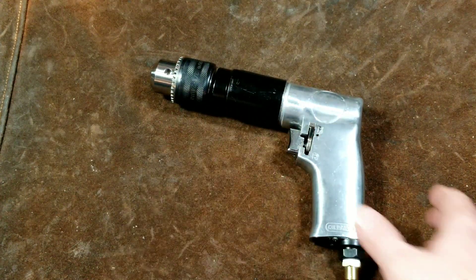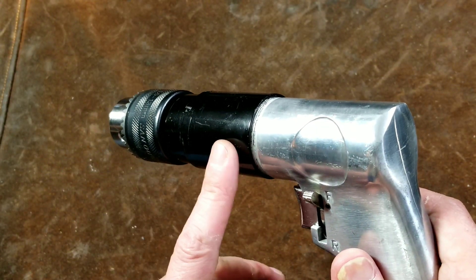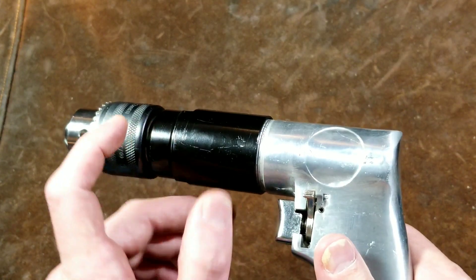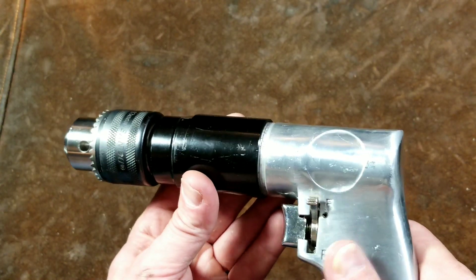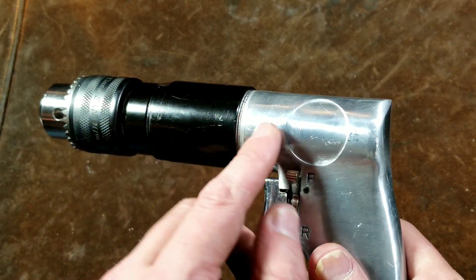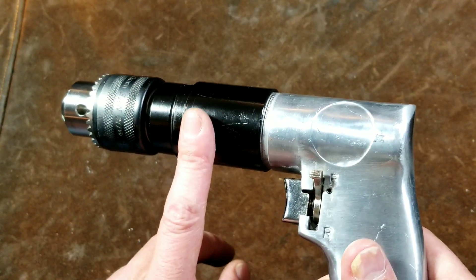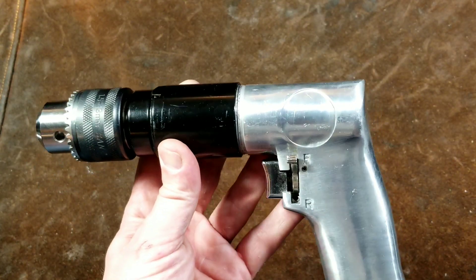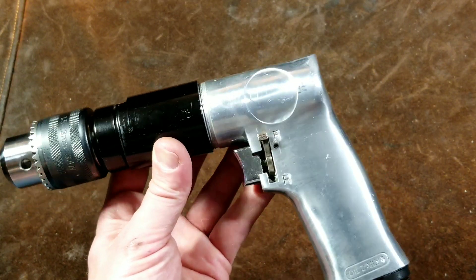On top of all that, I'll show inside how this air drill uses a planetary gear, and the ring gears in the planet are just completely floating — they're held in tension by compression of this fitting here. That causes issues where, over time, it starts to wear out a little divot in the housing, and they will start to slip. So you'll be drilling and it'll just start slipping, even though the motor is turning. So there's just a variety of issues with this air drill, even though it is cheap.